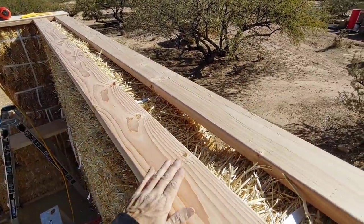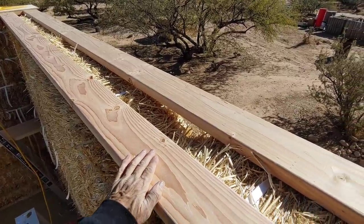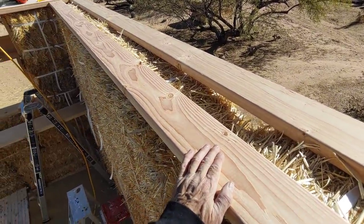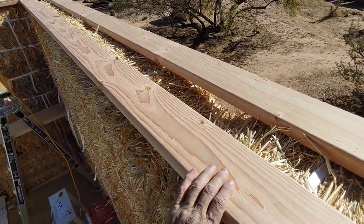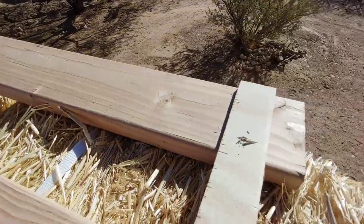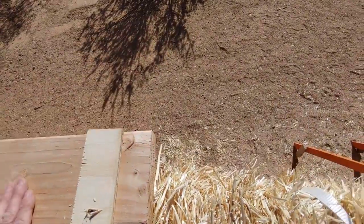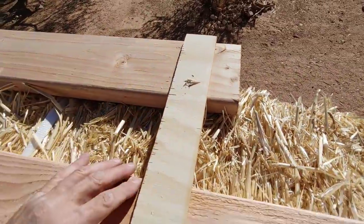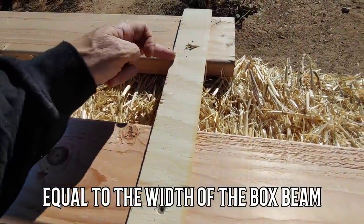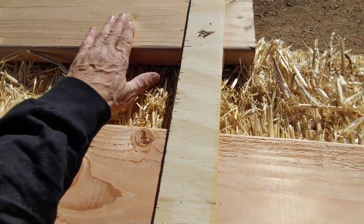I ran into a little issue here on this last wall. This is the wall right here that we were having problems keeping vertical a couple videos back. After I took the tarp down after the storm, this wall really became buckled in, and you can see that by how the outside 2x6 wants to hang off the wall. So I took a 16-inch wide scrap piece of plywood and screwed them together to prevent this from falling off the wall.